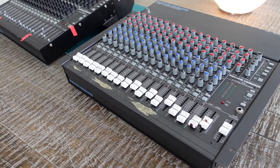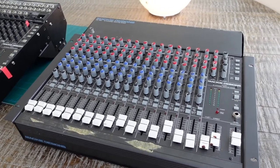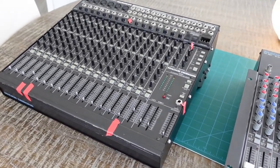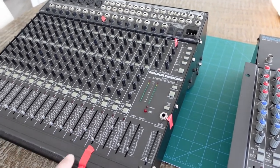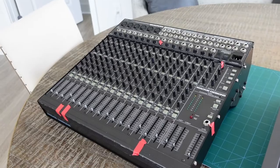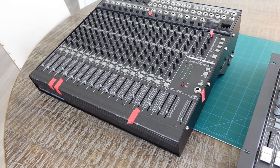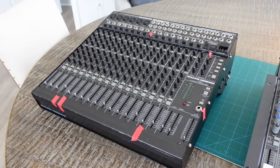People have also started to realize these distort in a very nice way. This model was superseded by the VLZ version, but this is the original, which is what I wanted to work with. This is the second unit I've gotten - you can see all the knobs are off. I bought this one for $50 and have done some rehab on it. It has bad faders which I've marked, and I've had it all apart cleaning faders. It does function except for the things marked in red, and the solo channel doesn't work right - the solo bus isn't coming through in stereo.